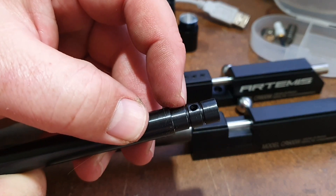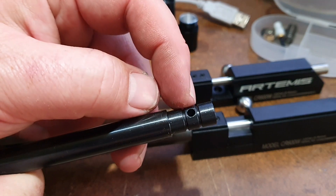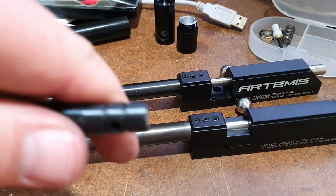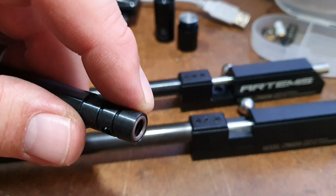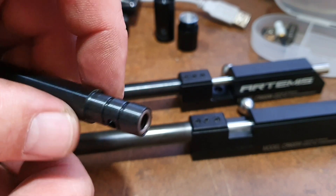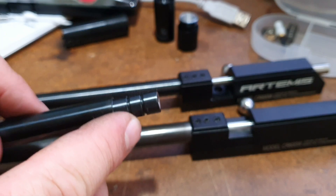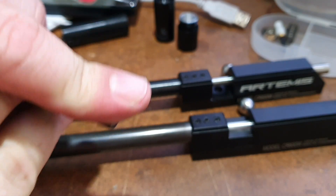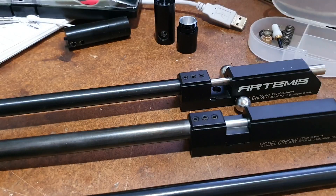As you can see we've got two o-ring grooves here — this is the original 22 cal barrel. Two o-ring grooves each side of the transfer port, and in the end there's an o-ring that seals against the probe instead of the probe having an o-ring on it. There's a bit of machining involved to get the o-ring grooves in the right place, to get the transfer port in the right place and smooth, and to get that o-ring seated and the right size.